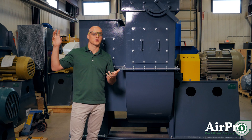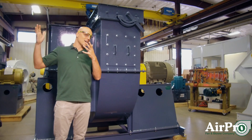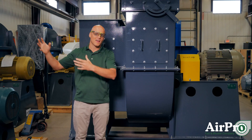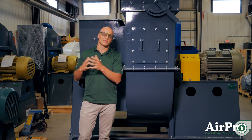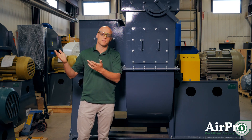So where should your pressure gauge be? If you have a bag house, your fan is designed to keep the bag house still pulling from the facility at the amount of air required to move the correct volume of air at the worst case of your bag filters. When the bags are clean, you don't need to run your fan quite as fast to still get that same pull.